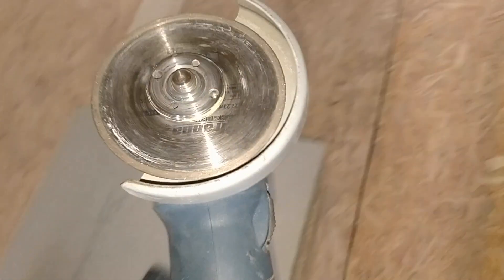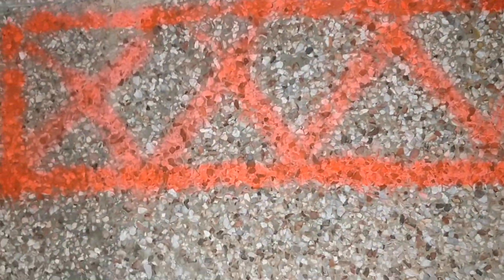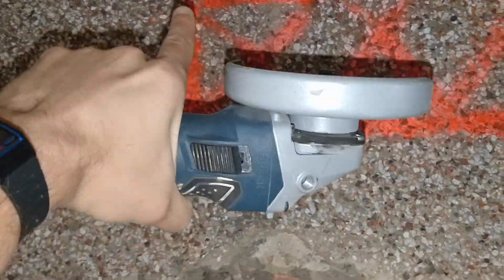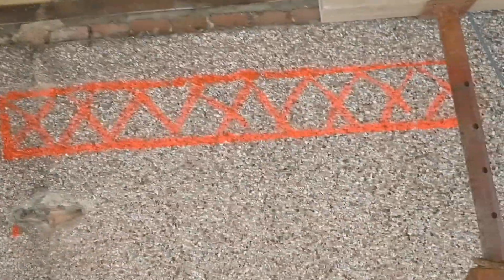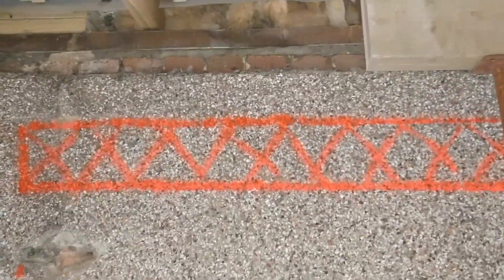All I'm going to do is cut very neatly and cleanly into here. I'm looking to get through the depth of the pebbledash — I'm going to strike down along here where the pebbledash is, pop it off using the hammer drill and SDS drill over there, and then I'm going to get a really good look at exactly what I want so I can line them up and figure out the exact width and spacing. So I'm just going to sort that now.